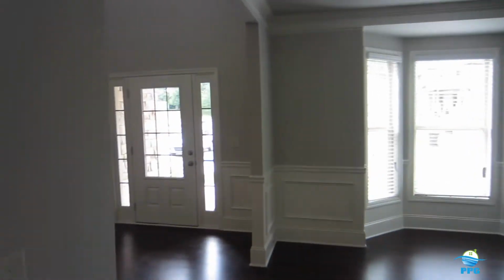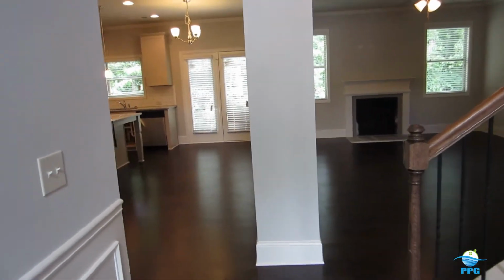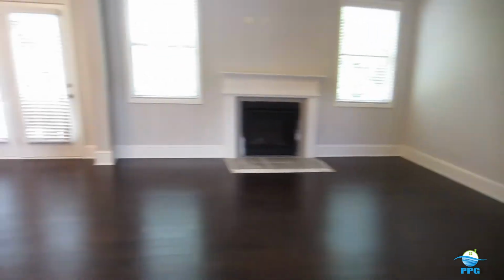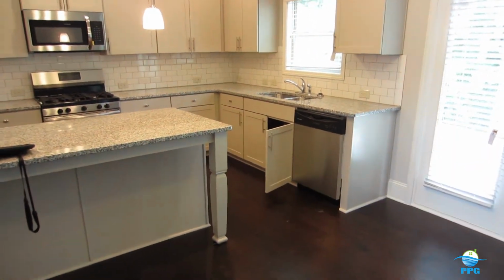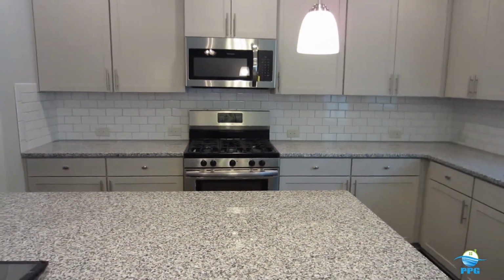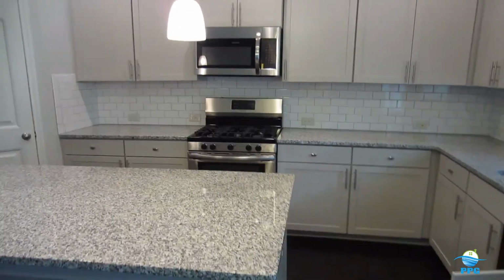Tamper-resistant outlets are, down here in Georgia, required basically throughout the interior of the house. Every outlet should be a minimum tamper-resistant. That's on new construction. Those are little outlets with the little baffles in the slots that require both prongs to be inserted at the same time to energize that particular receptacle. And these, you can retrofit these. If you're in an older existing home, if you have just conventional receptacles, you can retrofit these.